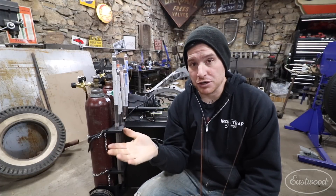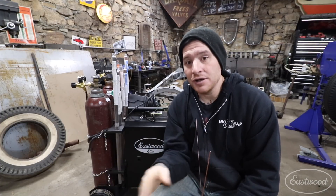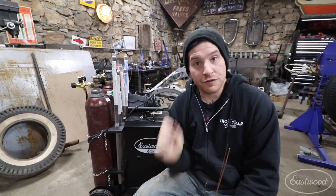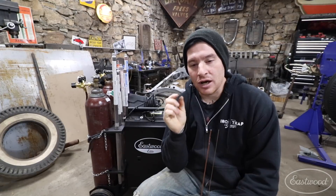For structural type welding like chassis work where you're welding heavier materials — 14 gauge, eighth inch, and thicker — you're going to be going up to 3/32". Once you get to that level, there may be some personal preference as you get more experienced with TIG welding. You may choose a 1/16" rod over 3/32" because you like to feed more filler rod as you go, rather than doing larger drops of filler rod less often. So that gets into personal preference.